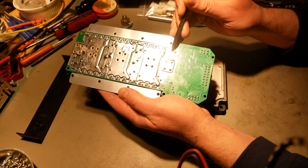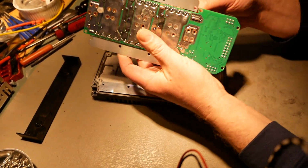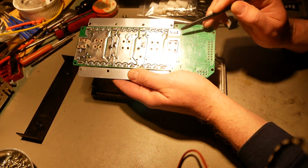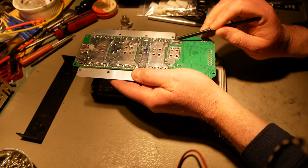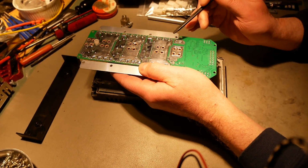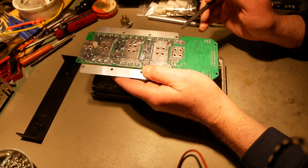And the other side of the shunt right here is touching this piece of copper right here, and they're soldered together. So as far as current path is concerned, this is excellent. This is not a problem waiting to happen in any way. If that battery minus bus gets warm, I would be astonished.